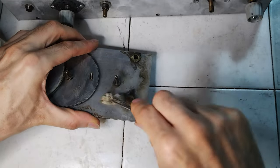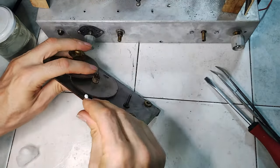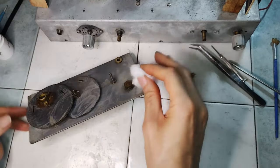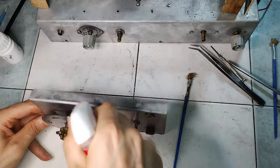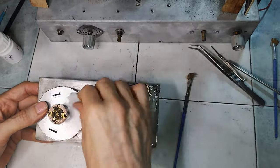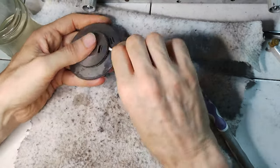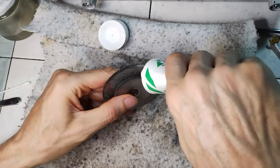These clips show the cleaning process using acetone, alcohol, and a gel rust removal product. The rust removal product is always washed with alcohol, but later off camera all the gears have been washed with water and dish soap, then rinsed and washed again with alcohol. In the end, a lot of Vaseline grease was used to add extra protection to all the gears.